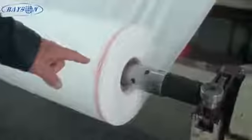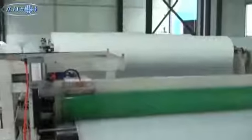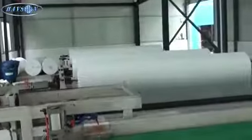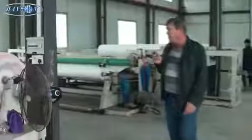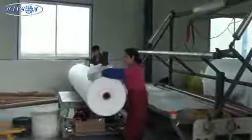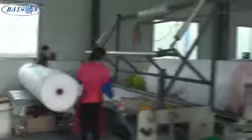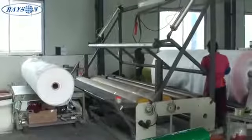What you're seeing here is one of the glue machines. The glue is injected through small tubular lines. Down here at the end, you should be able to see the finished glue lines. There's a cooling system just past the glue machines, which cools the glue. Here you're seeing the finished glue lines on the product, consistently in width, each glue line.